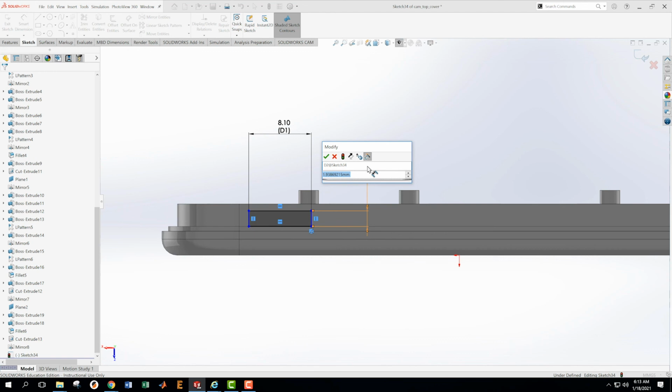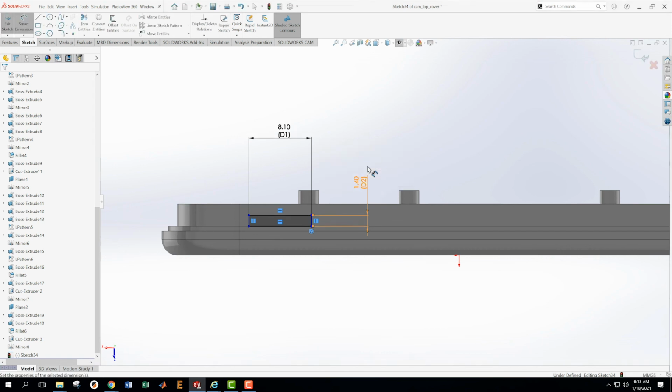Yeah, and so all these little slots, you can see on the far left of that drawing on the side view, it says 7x 1.4. That means all of these slots, all of the features that appear to have that same geometry have that same number. So that's 1.4 in terms of its height. Okay, great. So what have I done?